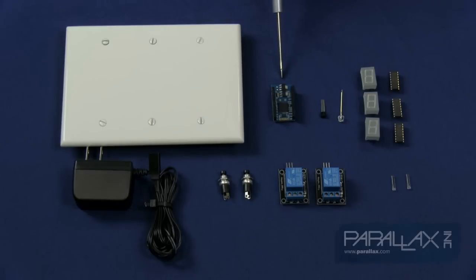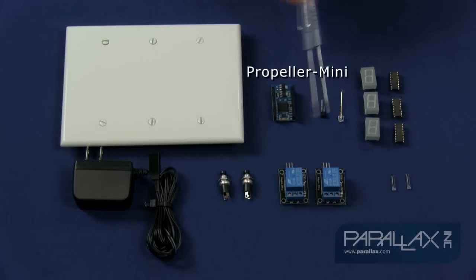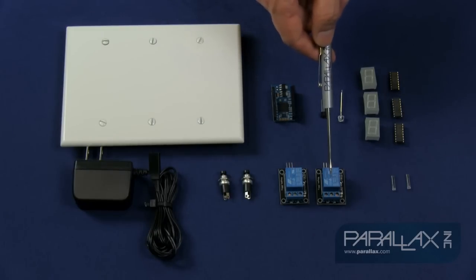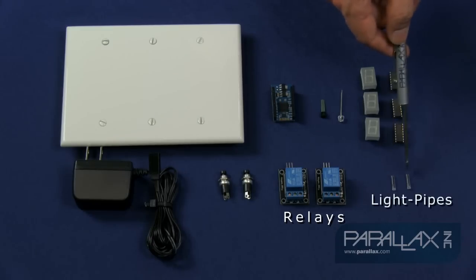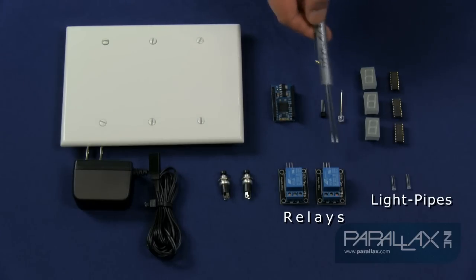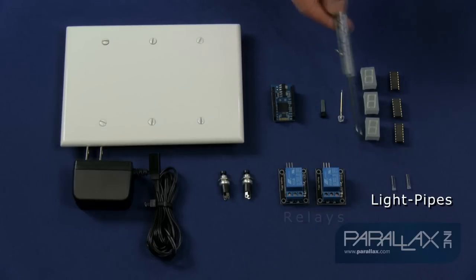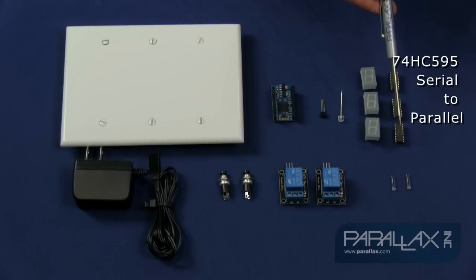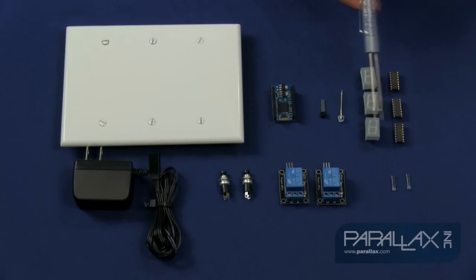Basically I had a switching adapter that was in the wall that allowed me to convert that high voltage. This here is the brains of the system — it's the Prop Mini that monitors the two sensors, the temperature sensor LM34 and the photo transistor, and then it uses the data coming in from the switches and the sensors to switch on and off the lights from the relays. The light pipes will show you the LED status on the relays, and then the seven segments here will display the temperature. These ICs are the 74HC595 serial-to-parallel ICs that connect up each to the seven segments to run those.